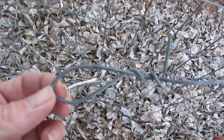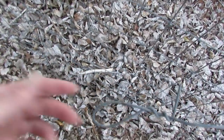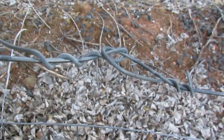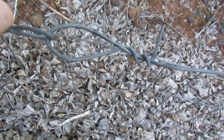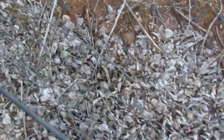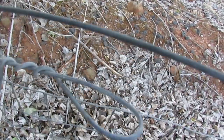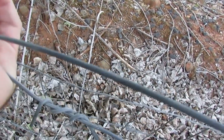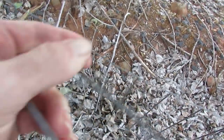What we'll do is make another loop with our spare piece of wire from our roll and attach it to this end, leaving the other end open. Here we have our end tied. We're going to keep the loop out, but it's really not going to matter because we're going to put so much force on here that you could pull this whole fence over. We measure from our new loop and we don't need too much past that — just a little bit. We'll cut it off right about here, giving yourself about 8 to 10 inches extra.